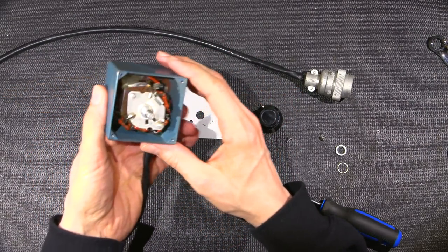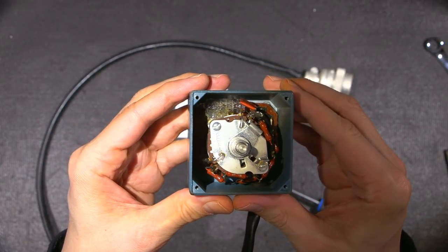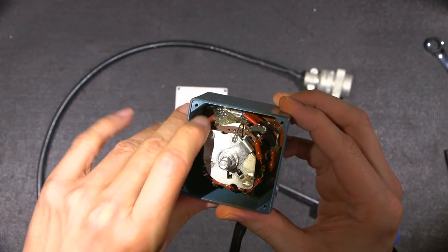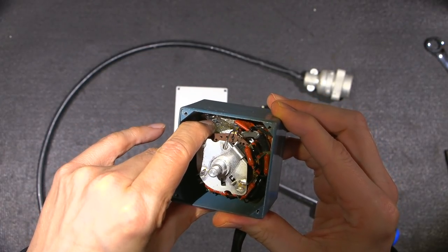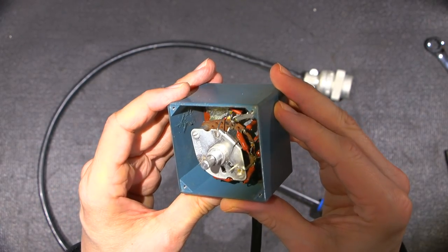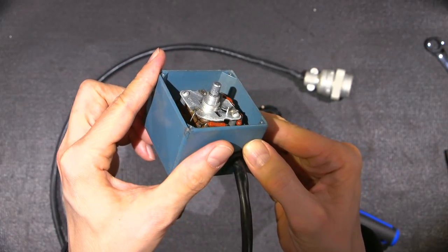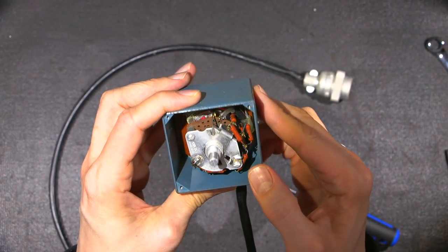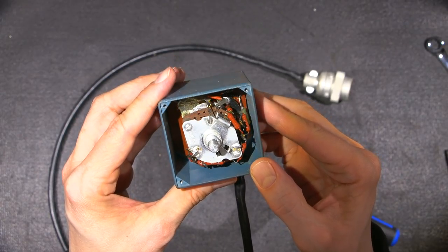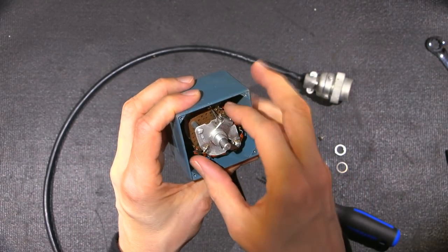There it is. Take a look inside. Look at that little tube down in there. It's a cute looking little tube. Gold lettering on it. Looks like it's been glued into place. Feels like silicone. And those are the resistors on the attenuator there. So obviously, this would use a good contact cleaning. Clean it all out. And I imagine it would be pretty good at that point.